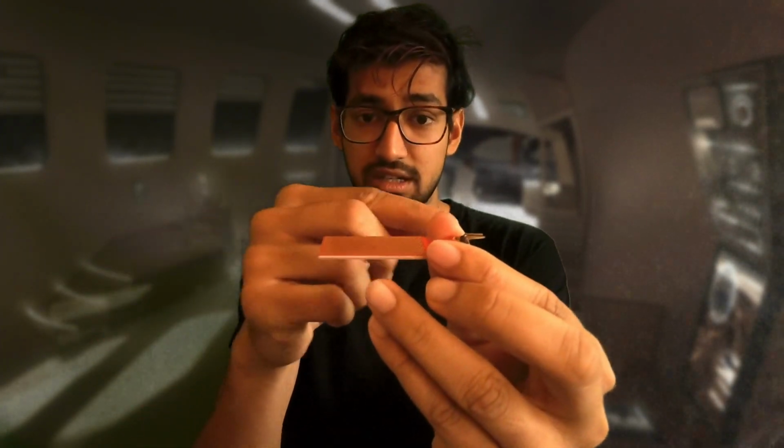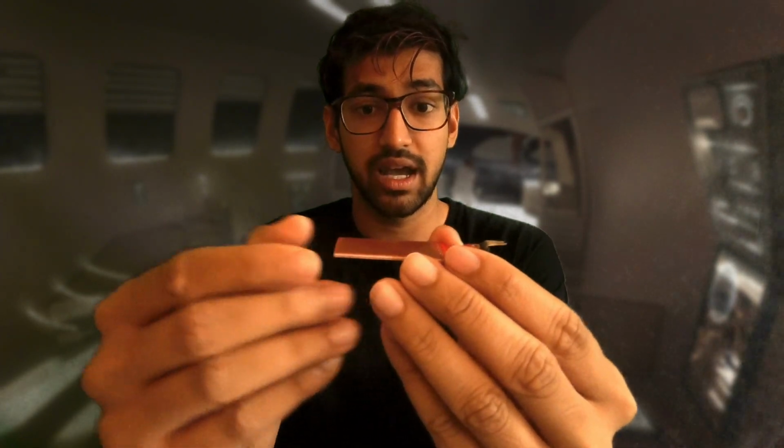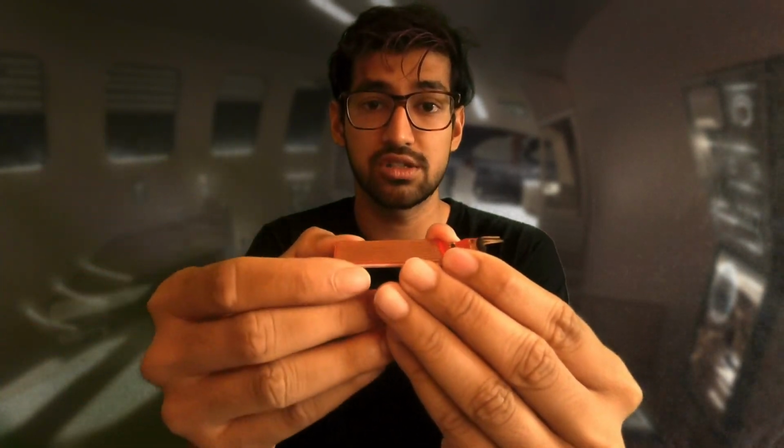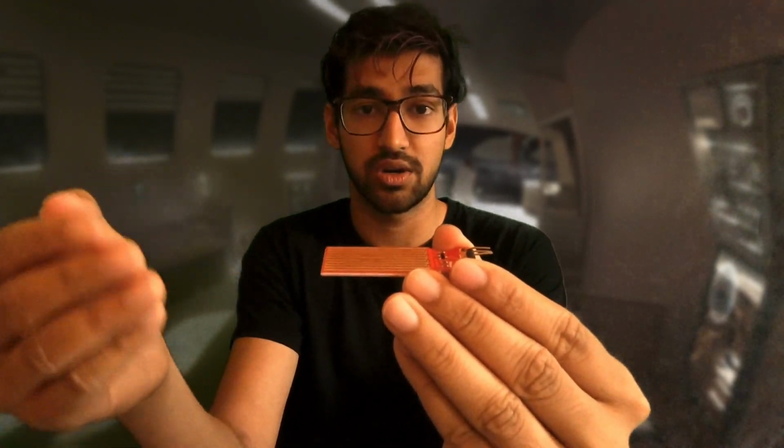Typically, this numerical value ranges from 0 to 1023. One drop of water will register some value, and the more drops of water that fall onto the sensor, this numerical value increases accordingly.